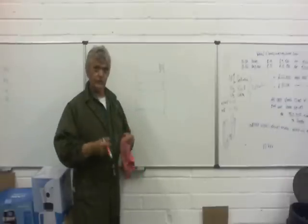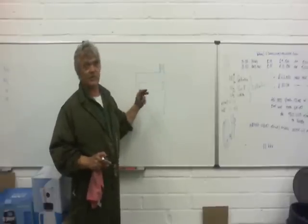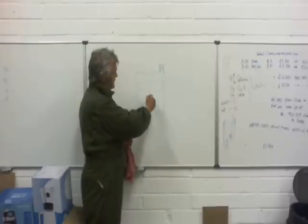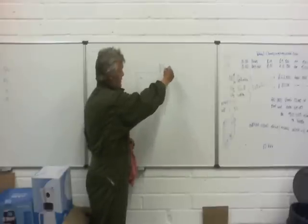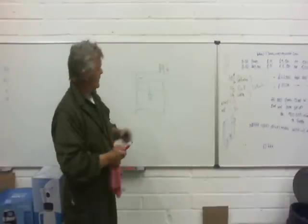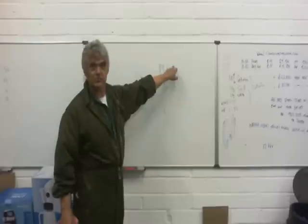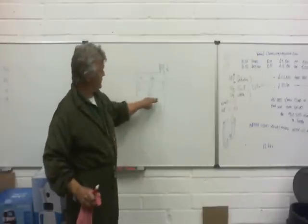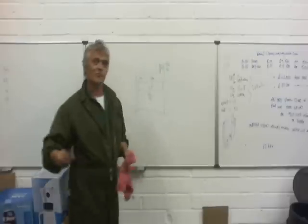Now when we look at a standard Stirling engine using the piston movement, there has to be a difference between where the displacer is and where the air is getting heated and cooled — and it's 90 degrees out. We call it 90-degree phase displacement. When the displacer moves down, the air is forced into the cold region and cooled, and that cooling means the piston will then move down — it moves down after the displacer has moved down. The displacer has to move first so that the air gets into that region and cools, causing the pressure decrease which moves the piston. Once that piston has moved, we want to move the displacer back up — all the air is then forced into the hot region, heats up, expands, and that moves the piston back up. So that phase displacement is really, really important.